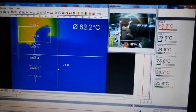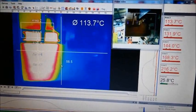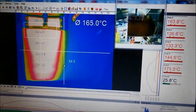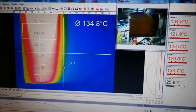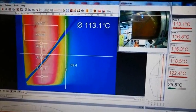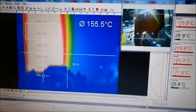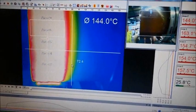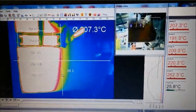On the right side, we can see the temperature displayed in areas 2, 3, 4, 5, and 6. We've gone by one time with the coil, and you can see we exceeded 180 degrees directly behind the coil. Now with time to soak in — a little bit of conduction — we're left with a residual heat of around 80 degrees, and now we come back.